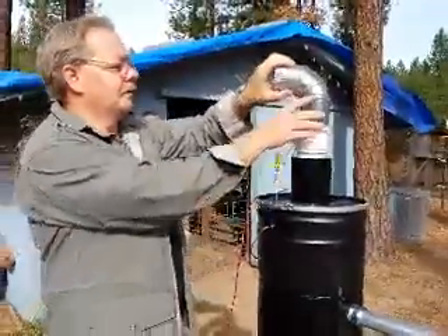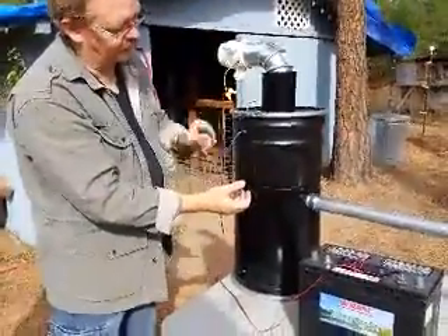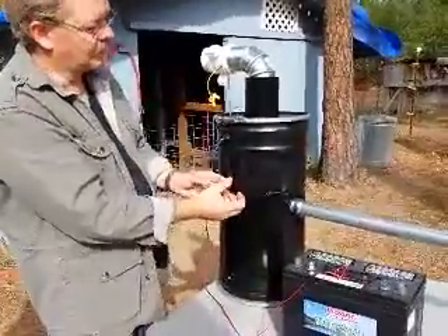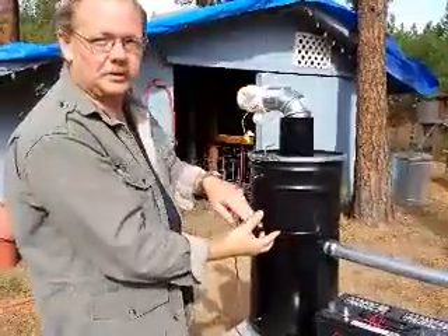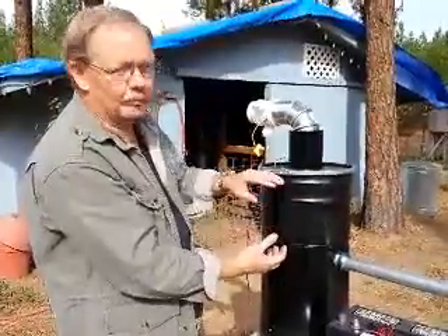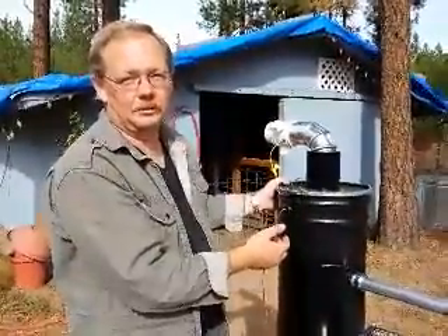At that point, you flip the fan over so that you're pushing air down through the system. You've got the wood on fire, the air is being pushed down past it. The heat of the flames is cooking the wood above it. Initially it's just burning and creating smoke. But as the heat of that fire grows to the point that it's burning all the oxygen, the wood above it is being cooked by the fire — and that's what cooks out the hydrogen, methane, and CO gases that you need to run your engine.